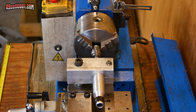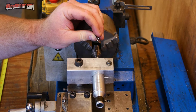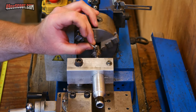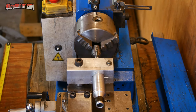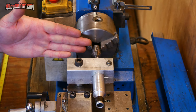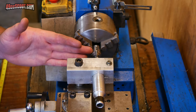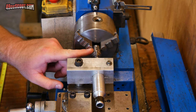So doing the math there, if I remove three of these washers, and I have measured multiple ones, and they are actually right on spec each one at 47 thousandths, then that will take me down to 141 thousandths, which is too much because I'm looking for about 105. I have some shims for variator spacing that are 1 millimeter thick, so about 39 thousandths, and that will take me to 102 thousandths cut. So I'm gonna start there.